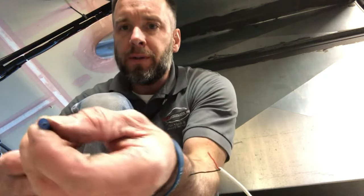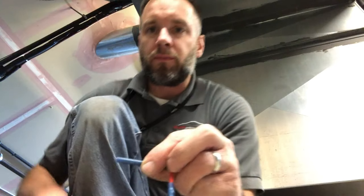An important point about using the butt connector: you want to make sure you get the right gauge. So if you're using 16-gauge wire, you need a butt connector that does 16-gauge. If you're doing 12-gauge, you need a 12-gauge. Make sure when you go into Home Depot you get the proper gauge butt connector.